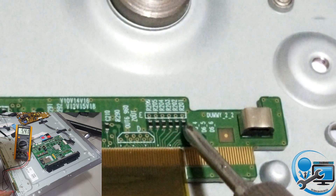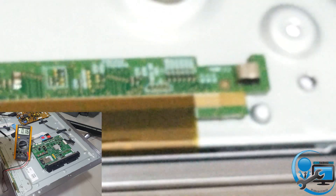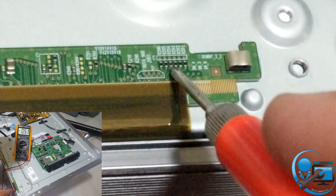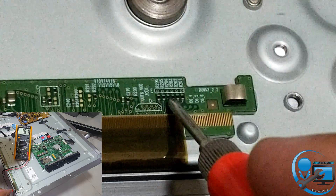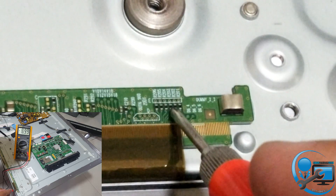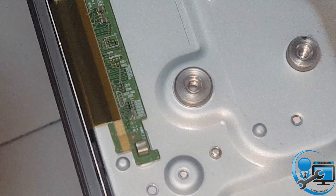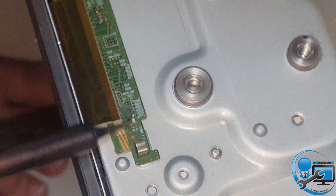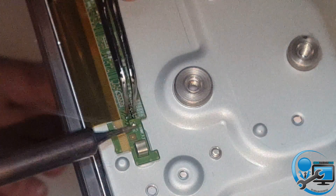Look for a fluctuating voltage like this one. If you can see the voltage is fluctuating from 5 volts to 4 volts every two seconds, while the other resistor is steady at 5 volts, this means those two resistors are bad. If your TV has a double screen every two seconds, the reading will be dropping to 4 volts every two seconds.